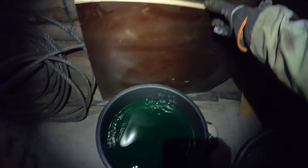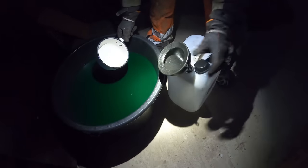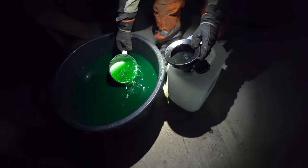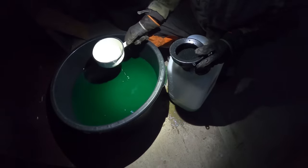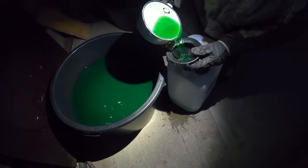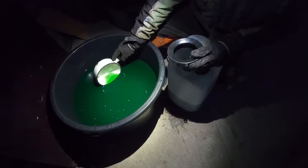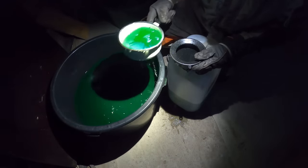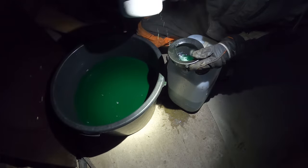I actually made the coolant for Joseph a couple of months ago now. I decided to use filtered rainwater, and the mix ratio was, I believe, 50-50. So this should be good up to minus 36 degrees. If you want to mix up the coolant yourself, remember that regular tap water is just too rough. You need some type of softener or something. But I've heard rainwater also works.